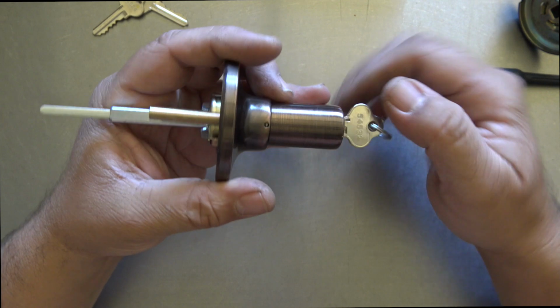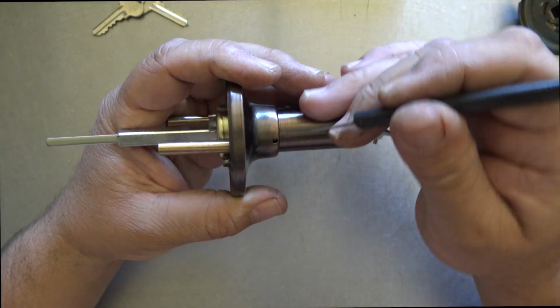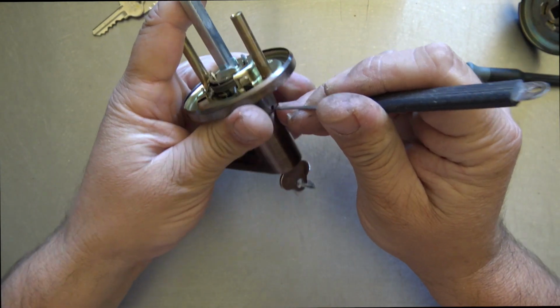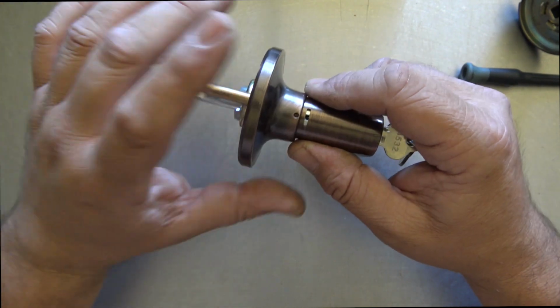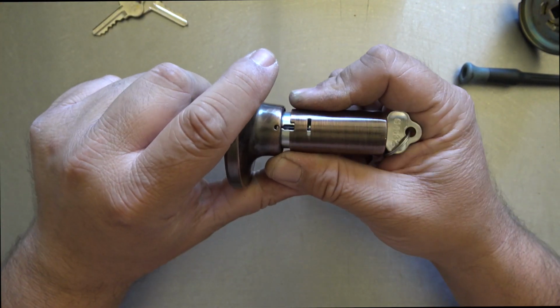So I put my key in, turn it a quarter of a turn. There's a little hole right here with a little button that gets depressed. I can see it, it's actually silver. I'm going to push that in there, and as I push I'm going to pull this knob towards me, towards the front. There is a tool also included with the lock. As I pull my tool out, it separates and I can slide that cylinder straight off the front.